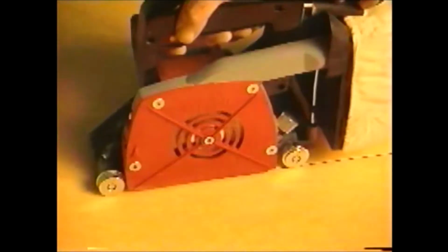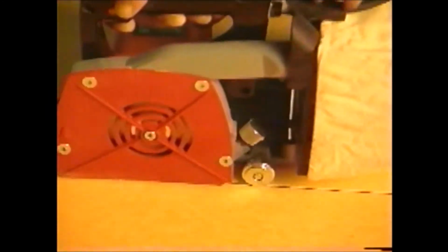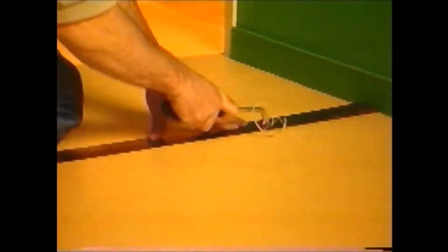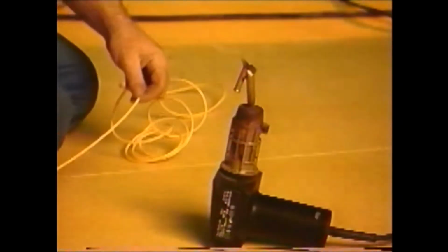For other E2 and E3 rated premises, heat welding will be carried out by firstly routing the edge with an electric grooving machine, finished at the end of the length with a hand gouge. The depth is to be a few tenths less than the thickness of the flooring to be welded.